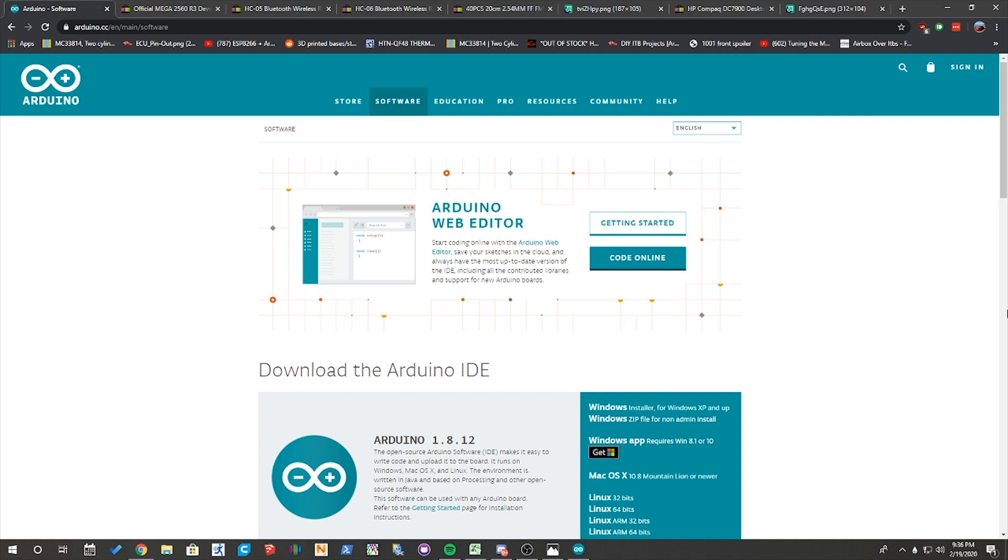You're going to need the Arduino IDE if you don't already have this installed — I'll drop a link below. One of the main reasons we're going to need the Arduino IDE is because we're actually going to have to reprogram the Bluetooth modules we order to the correct baud rate, which is kind of like the communication rate between the two Bluetooth devices. We're also going to have to configure the password for our Bluetooth module, because we don't want our friend changing our launch control at the line or something stupid like that. And we're also going to have to set the device name for the Bluetooth module.